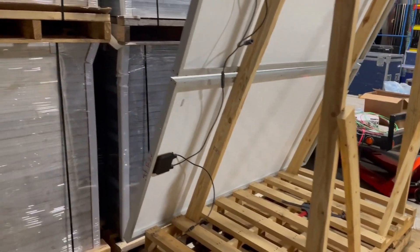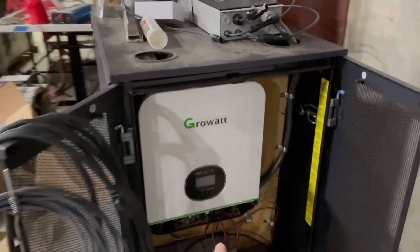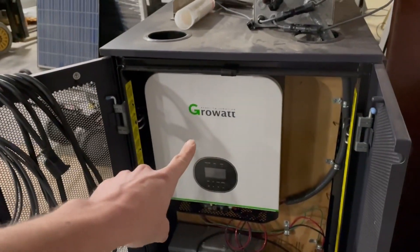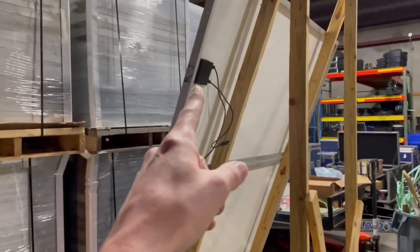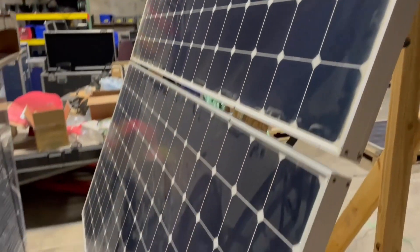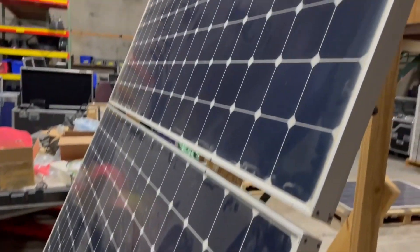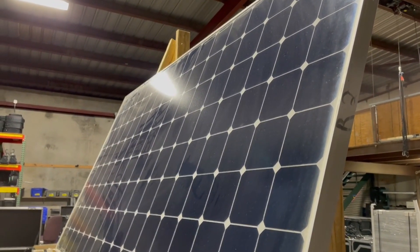What these inverters were really built for was newer panels. These behemoths are SunPower cells — 128 cells in series — that's 85.6 volts per panel, but you get 435 watts off of one of these. That becomes a problem with older inverters that can only go up to 145 volts. But at 85.6 volts you can do five SunPower panels in series and still be under the 500-volt limit, run a second string at six amps, get yourself 12 amps coming in, and now you've got 4.35 kilowatts coming into the inverter.